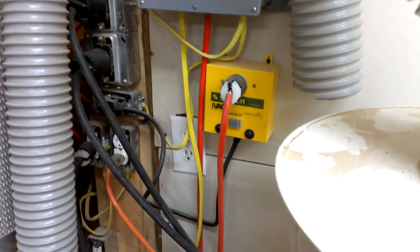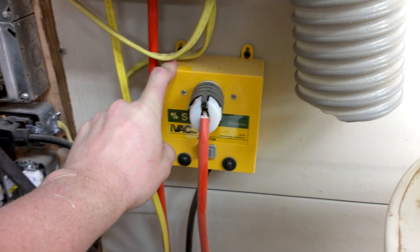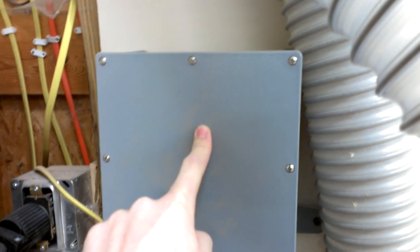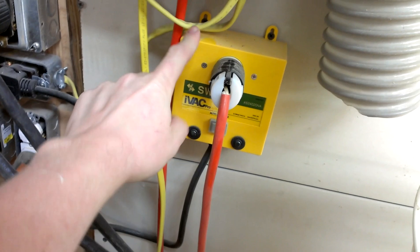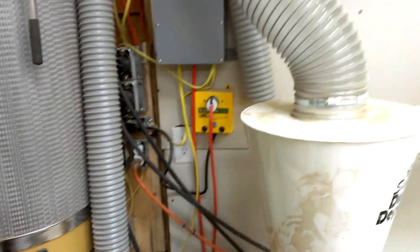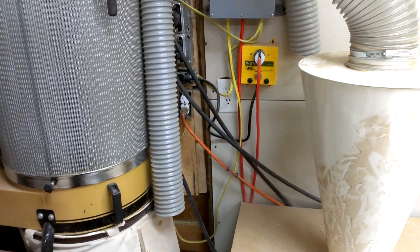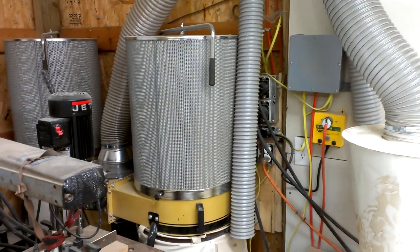This is how I have the iVac wired in. The iVac is only supposed to be used up to one or one and a half horsepower, so what I have it set up to do is run a contactor — like a 10 horsepower contactor — that I put in that housing there. All it does is switch the contactor on and off. You definitely don't want to use the iVac to actually switch a big load like this. You can kind of hear the contactor there — that's a monstrous 50 amp contactor in there.